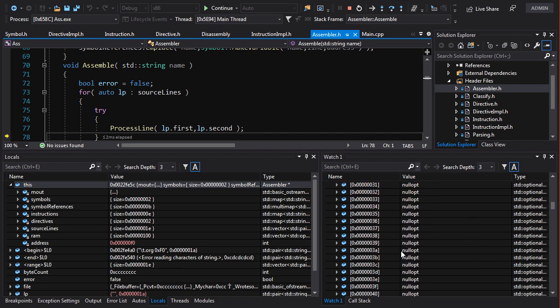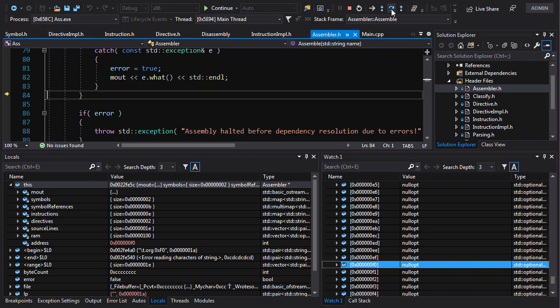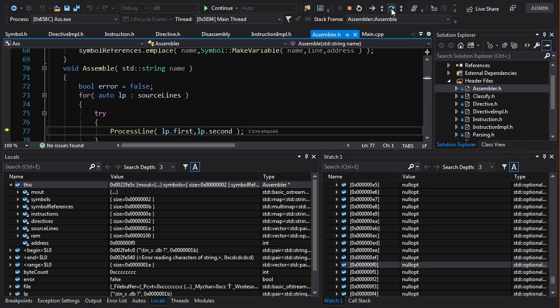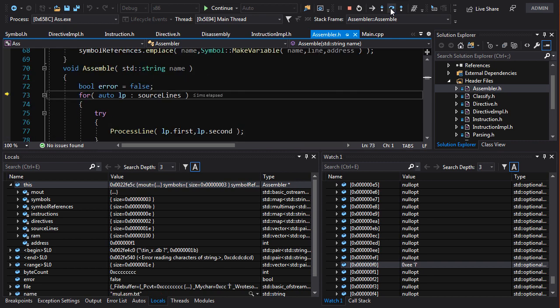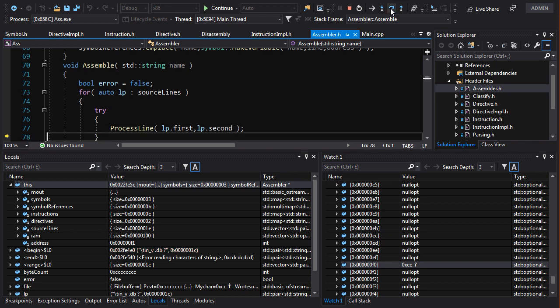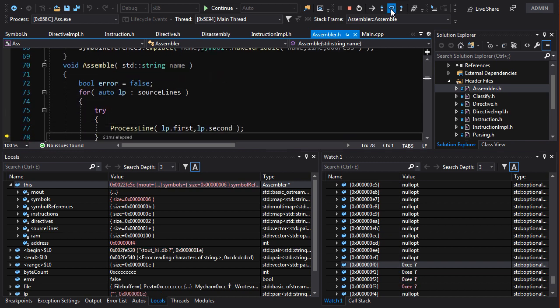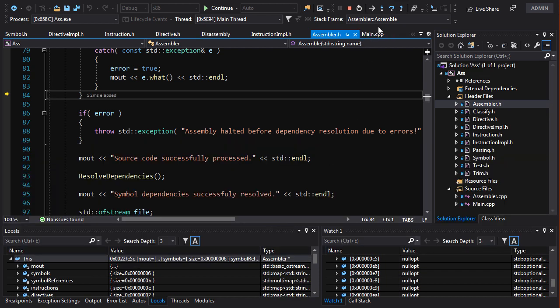And then if we look in our memory here at F0 and we start to process lines, it is going to start to fill them with EE, which is the placeholder for defined byte when you just want to define the byte and address, you want to give it a value. So there we got EE there. And if we step over again, we get another EE, we get another EE, we get another EE, and we're done. We should be done.